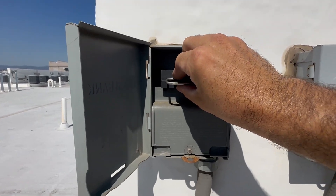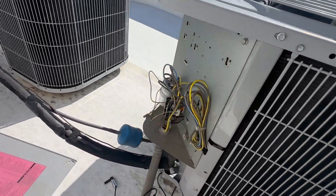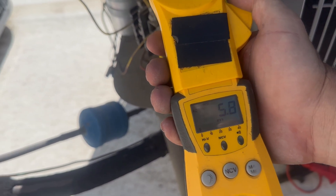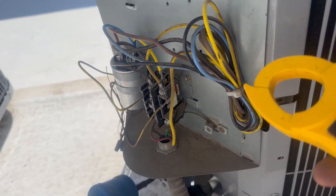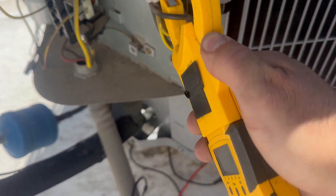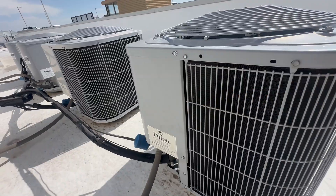We've got a call from downstairs because the contactor is pulled in and we are now running. We've got 5.8 amps on our 14-gauge common wire to the compressor. The fatter wire going to the fan is actually only 16-gauge, meaning the conductor inside the insulation is smaller. We've got 0.5 amps on our fan motor — fan motor is right at 0.5 max — and our compressor RLA run load amps are nine, so we're at 66% capacity, which I like.